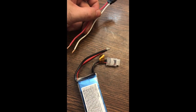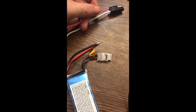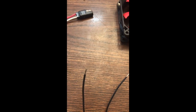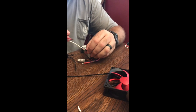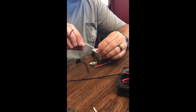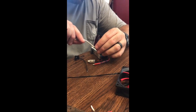First, what we're gonna do is take one of these quick connects and wire it to the battery. That way your battery pack will be done. We're gonna put the red to the red and the white to the black. Just push them together like that, push them the best you can, and then slide this back over all of that until you get the solder right in the middle. Now once you get it like that, take the heat gun and put it on low.